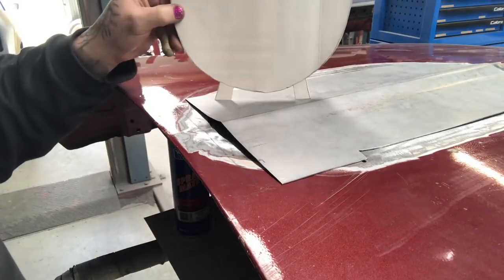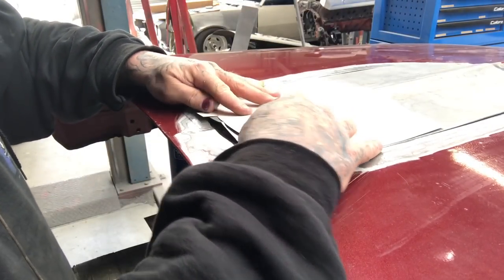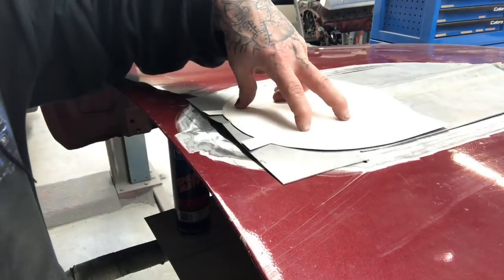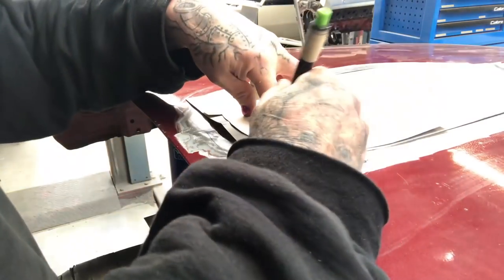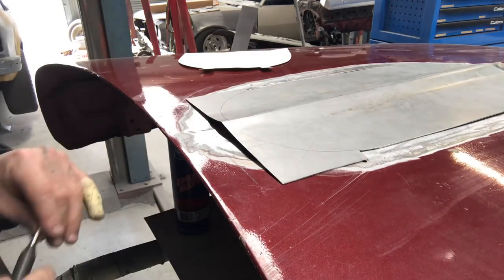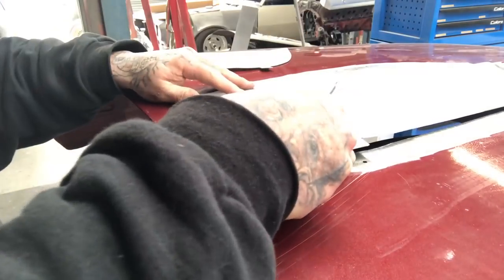There's my little cardboard bit cut out - it's going to look a bit funny. I can line that up with the bottom of the steel with those little feet, then get my pencil and trace around this. There's the rest of my mark-out. These two little pieces I can just freehand - again I'm going to give this about a millimetre or so extra as I cut it. And that'll be the rest of my little infill piece.